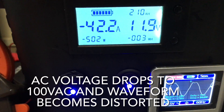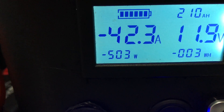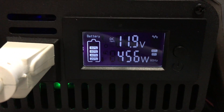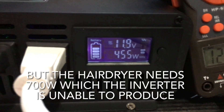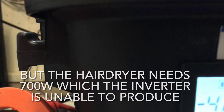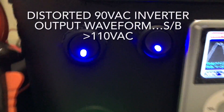Right now the battery is producing 500 watts in order for 455 watts to go into the load. The efficiency is 455 divided by 500. And with that load on, here's what our sine wave looks like.